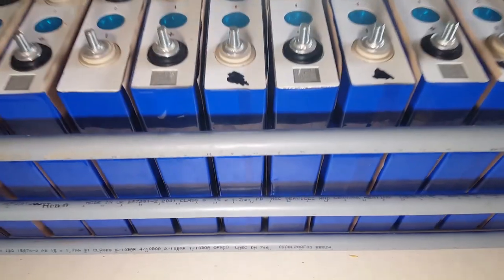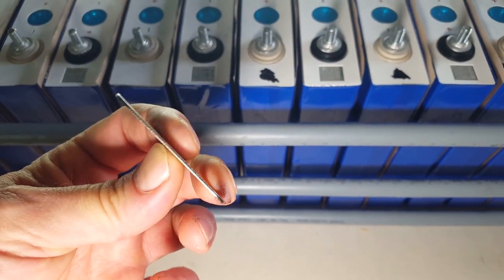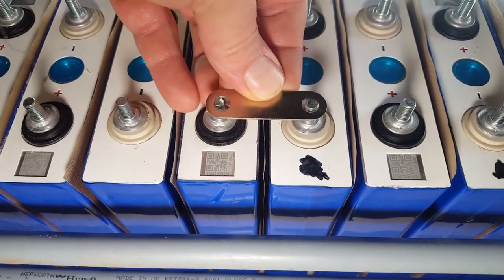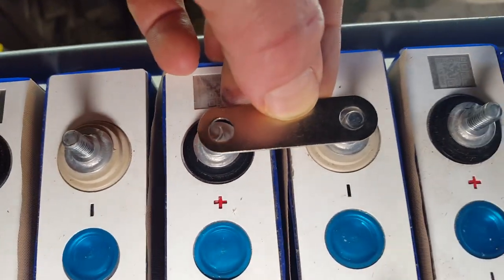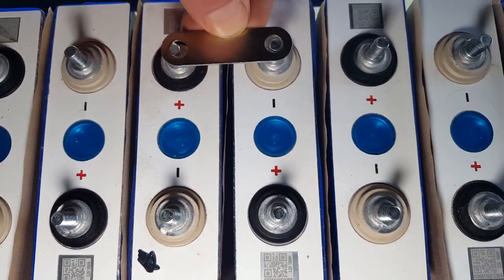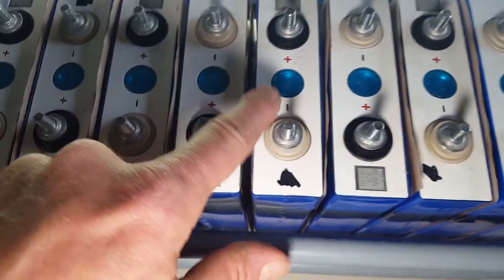The other problem is the little bus bars that come with the batteries — supposed to take 100 amps through that tiny little plate, which seems dubious. The problem the bloating gives me is that the bus bar no longer fits on any of them; it's quite a bit short. So fingers crossed, I'll give them a little squeeze to a point where the bus bar will fit, and I'll leave it at that. I'm not going to take too many liberties.